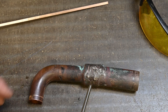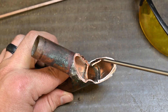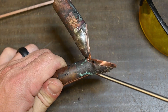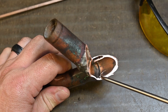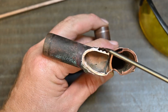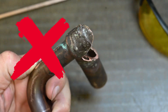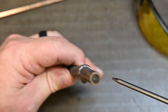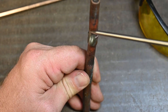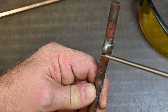They actually put the brazing rod on this side, trying to make it look like they pulled it into the joint even though they weren't. So that's a bad braze. Some people say their braze may look bad but it's a good braze — let's cut it open and find out. In this one, the top has a major shortage — pulled up only about halfway. On the bottom it was pulled up all the way. The bottom did great; the top was definitely lacking. This blob was most likely on the bottom. They did a good job trying to fill it, but there's still a ledge. The bottom is solid. A lot of people get worried about excess blob, but I'm not real worried — it's just a waste of product. I'm more concerned about having a leak.